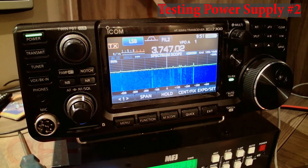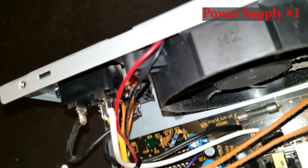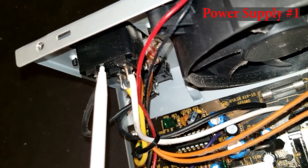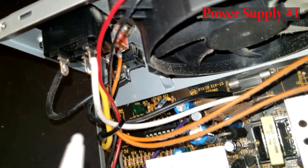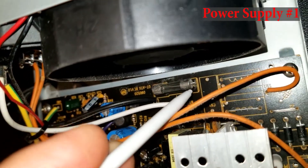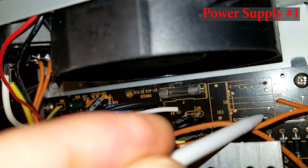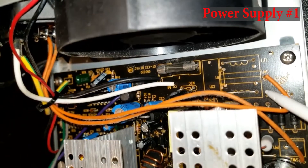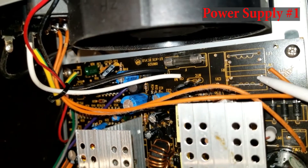After testing, I opened both boxes. This is the first power supply. The input from the connector goes through the on-off switch, then into a fuse. And here is where we should see filters — but obviously there are two inductors and one capacitor that are missing, plus a few other components are missing as well.